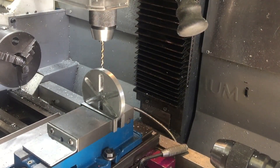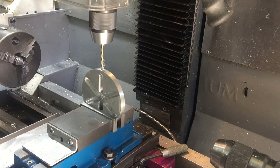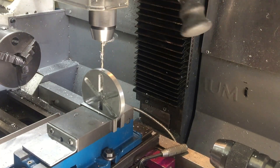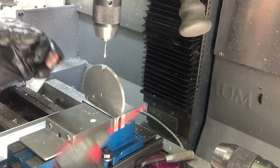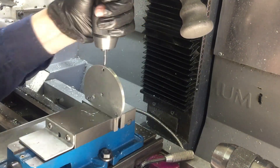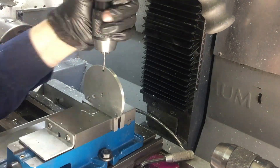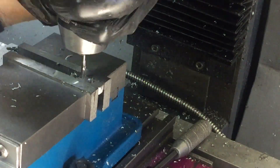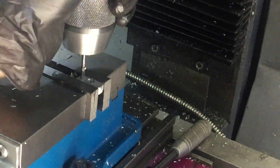At the opposite end of where the cable comes out of the base, there's going to be a screw that goes in the side. This will tension the cable once everything is together on each of the three cables. I'm using an M3 for this, so I'm just carefully threading it by hand. I'm threading the top at the moment and this will also have a little M3 bolt that will hold the top of the cable through a loop. You'll see how this works when I put everything together.